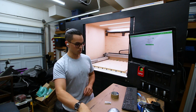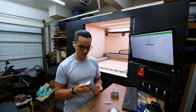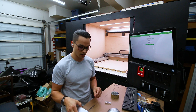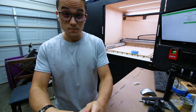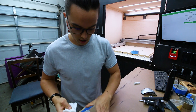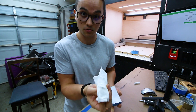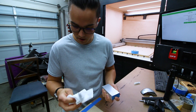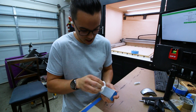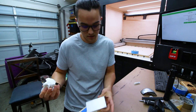The only con I'm going to run into is the fact that I don't have the best work holding. Traditionally with metals you use vices - I don't have a vice for this machine. So I'm going to be relying on double-sided sticky tape. My only major concern is that I'll generate enough cutting forces to lift the workpiece off the bed, at which point it will be a prompt oh-shit-button moment. Something worth noting: because I'm stuck relying on adhesive work holding, I'm going to clean the workpiece - any residual grease or grime will affect the adhesion of the tape and its ability to resist cutting forces. I'm going to give this thing the best chance I possibly can.